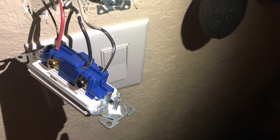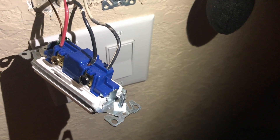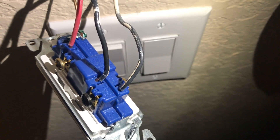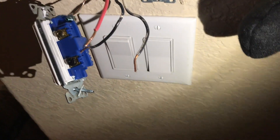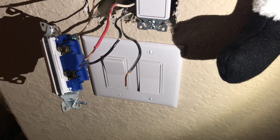What I have to do is troubleshoot and determine which wire is the power coming from the building and which wire is the traveler. I'm going to pop the wires out of the switch — they're using the regular push-in connectors, so you just wiggle them back and forth to get them out. I wiggled out the red and one of the blacks. Now I'm going to twist them together to make a contact, then go to the other side and check for continuity using my multimeter.